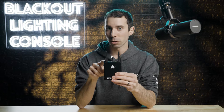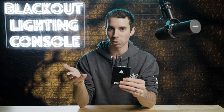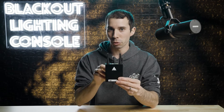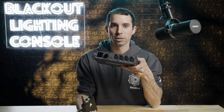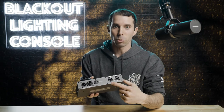This is the Astera Art7 box. Although it has two antennas, it's different from the AKS. One of them is also a CRMX or Lumen radio transmitter, but the other one is Astera's 2.4 gigahertz proprietary protocol that they use to configure and send data to their Astera tubes. This is how you're able to see battery percentage, change the addresses, change the modes, and put the theft alarm on — it's all through Astera's proprietary protocol and has nothing to do with DMX or CRMX. The only way to get DMX into this unit is through the dongle with the 3.5 millimeter jack, because there's no Ethernet port and it does not have Wi-Fi. It does have Bluetooth, but you can't send DMX over Bluetooth. That dongle is how you get DMX into this unit, meaning you have to go in from a gateway such as the Obsidian EN4, and obviously you would need to send ArtNet or sACN over Ethernet.